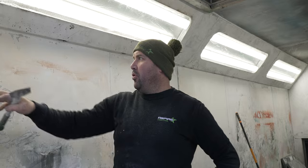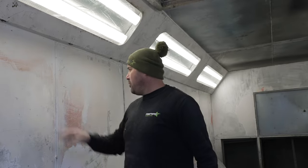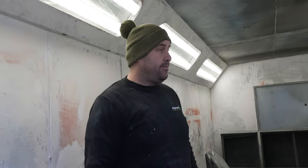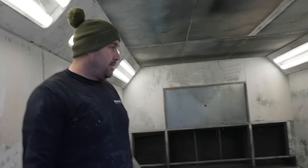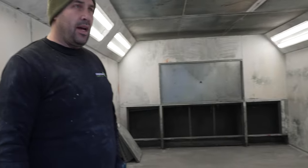What are we doing? We're just scraping the last of the paint off the walls of our spray booth. Once that's done, we use a sealer to seal all the gaps so that when the vacuum happens it's more effective. Then once we've done the acrylic sealing, we paint it and it'll be good to go. We'll have the ceiling and paint strip done today, booth ready for painting tomorrow including the floor. Then filters all in, get the air compressor, hoses and gas in. Hopefully next week we'll have a functioning booth.